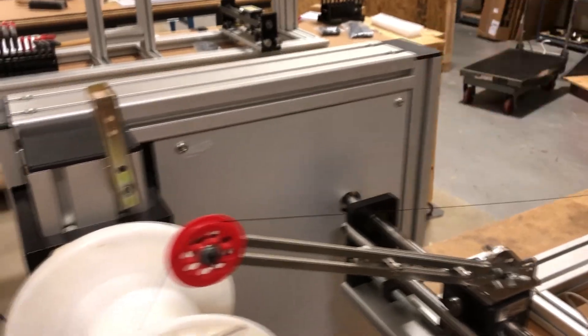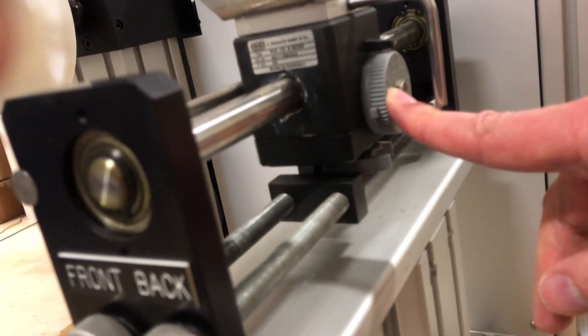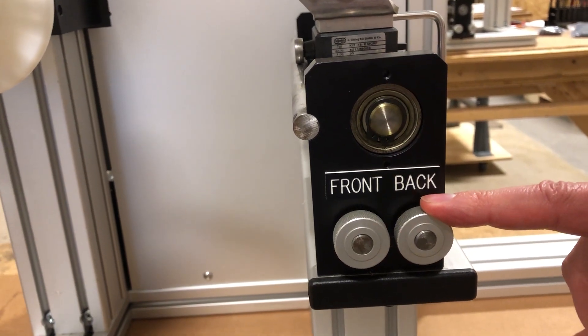The material will run up across our traverse unit, and this will lay it nice and evenly onto the new spool. You can adjust the spacing of the winding with the pitch dial on the side of the carriage of the traverse, and you can also set turnaround points with these knobs that will correspond to the flanges of your spool.